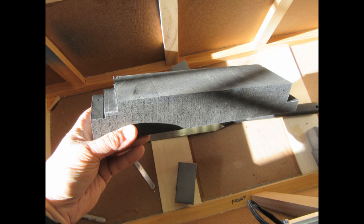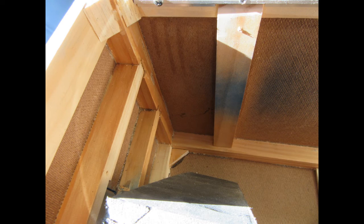Because I build a lot of cases, I stock this foam in 2-inch and 3-inch thicknesses. Here I am starting to form one of the 2 side pads for the rim of the instrument's bell. The foam has been sawn to clear the frame, edge reinforcement strip, and valance. The foam is cut to fit snugly and to contact wood in as many places as possible and on multiple sides.